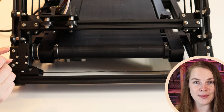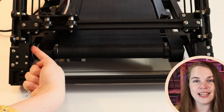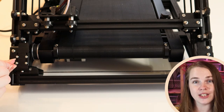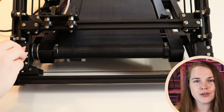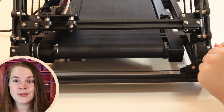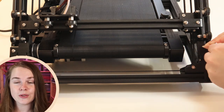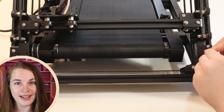There's also an optical sensor in here and you can use these four little screws to change the height of that one. I had to have it at the lowest setting — I'm not sure if this is specific to my machine, but that's where mine had to be. There's also a secondary manual stop which you can set just by unscrewing it, pushing it up against that bar, and screwing it back in.